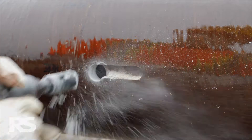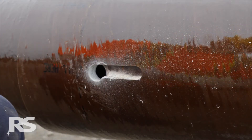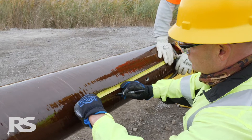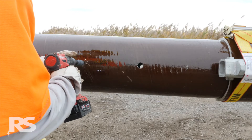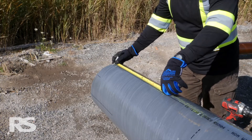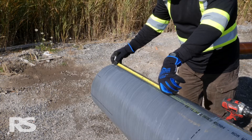Please see information at the end of this video clip for contact information. Before drilling, be sure to measure and mark carefully for vertical and horizontal accuracy. When measuring vertically, do so from the top of the pole, prior to the top cap being installed.